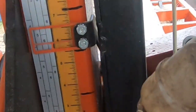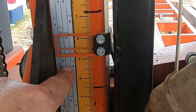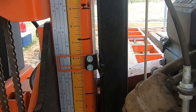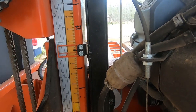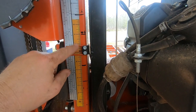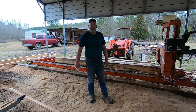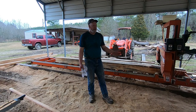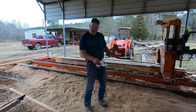Five and a half inches is right there. This is your regular scale that you're cutting on — these are to cut on inch and a halves. What they do is take an eighth inch off and add an eighth inch on every one of these so your boards are not skinnier than inch and a half. I go to five and a half, walk an inch and a half, which is seven. Remember I was on eight — I need to put that eighth in there for the blade, which is seven and one eighth, and that's to cut. I'm gonna make this a tall piece off the top. Louisiana weather is crazy — guys, I'm gonna cut this right here then break it down to six and I'll show you as I go.